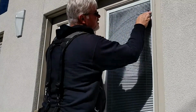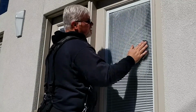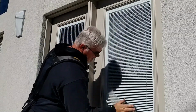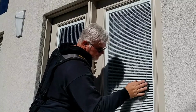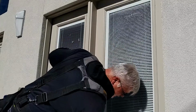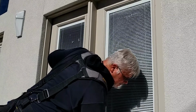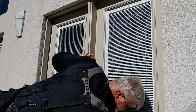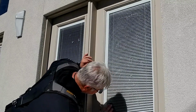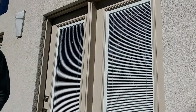I make sure that when I am wiping down or scrubbing down the glass, I do not get next to the edges. On this particular panel, we have painted areas. It is a fiberglass door that has been painted. If you get next to fresh paint and you rub too hard after putting some of your fluids on there, you can pull back the paint, which you would be responsible for. So please stay away from the edges with any steel wool.